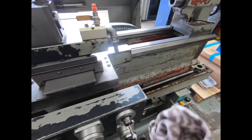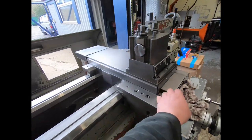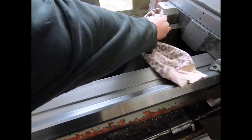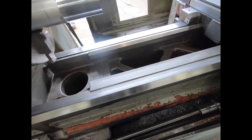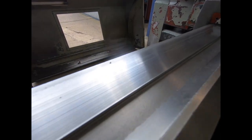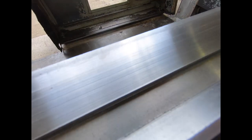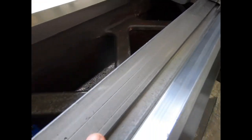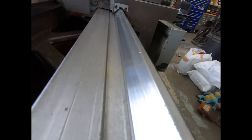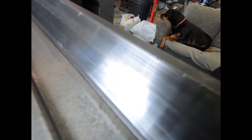I've got the ball screw and everything removed already because we've tried a fair few things. If I push this out of the way and wipe down here — now look at that. That unfortunately is what happens when you buy a lathe that's obviously been neglected and you don't look at it beforehand. They are relatively deep — hard to see — but yeah, a couple of big scores on this flat. And then if you look at this here, it's pretty bad too — it's got a lip on the bottom.